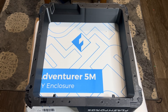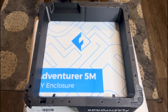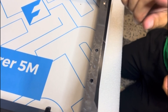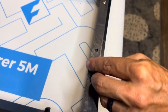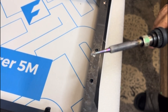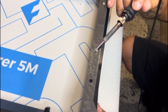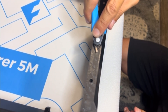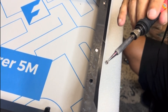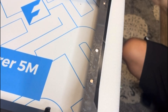Now move on to the top frame panel, which has a bunch of small magnets to install. These magnets can be really hard to install, so here's an easier way: grab a soldering iron and let it heat up, place a magnet on the frame and pick it up with the soldering iron. After a few seconds the magnet heats the filament and slides in super easy. Use a flathead screwdriver or side cutters to ensure it's flush. Repeat this on the whole frame — it leaves the magnets installed flush and tight, and saves a lot of time and frustration.